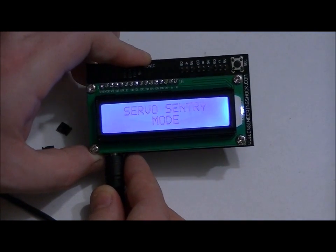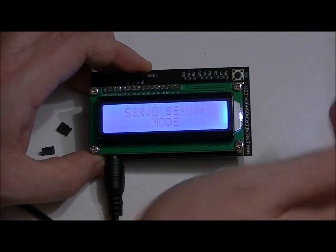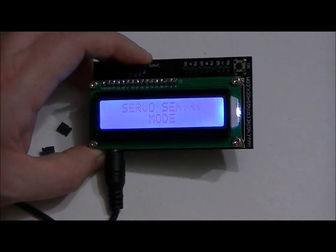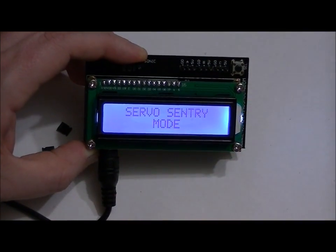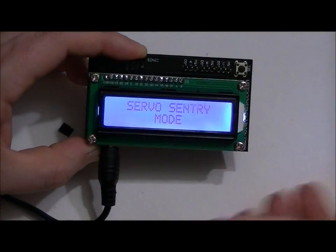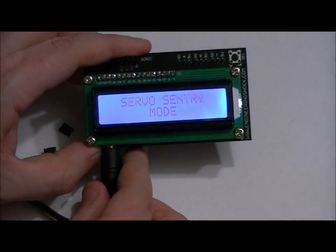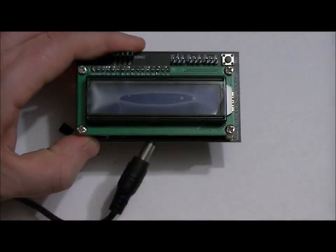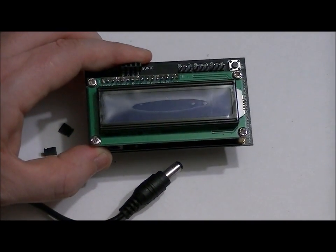And it will... it's entered into servo sentry mode. That's because the inputs that select what mode we're in are floating right now, so it'll choose a random mode. We need to select which modes using these two headers right here. We're not going to do that in this video, but it does work. Everything's hunky-dory. I'm going to remove power, and now we're going to solder together our servo motor printed circuit board